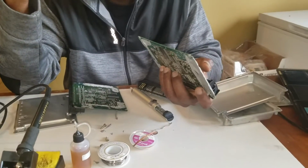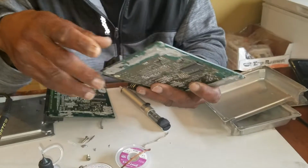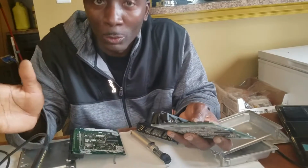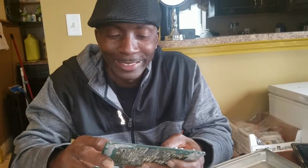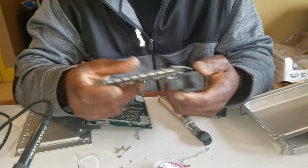And I knew the reason why that was happening, because the DME is from a different car. The EWS and the key, they are all from a different car. Even though they all have matching ISN number, it was able to start the car, but then the VIN that is in that instrument cluster is not matching with the rest of the VIN that's in the car. And I didn't like that. So I said, you know what, I'm going to have to dig a little deeper to find another way to try to fix this.